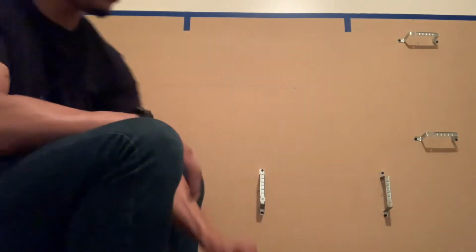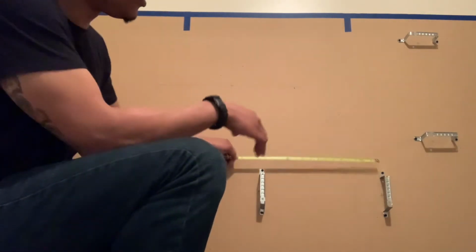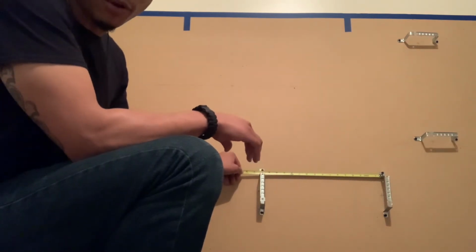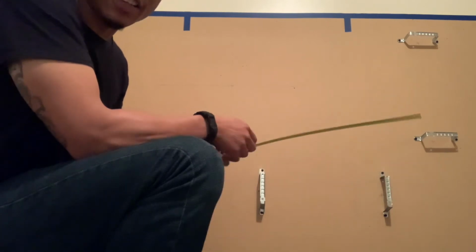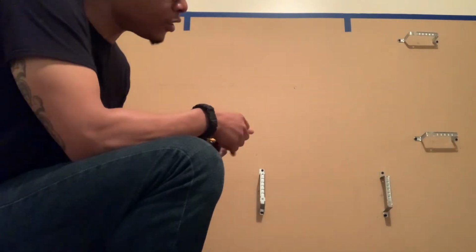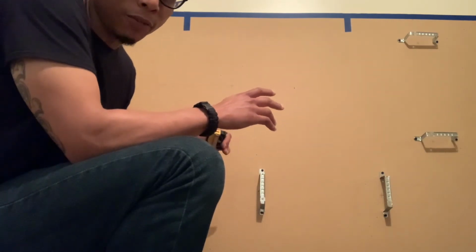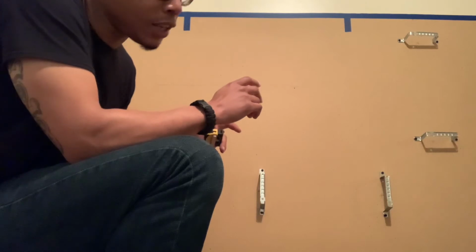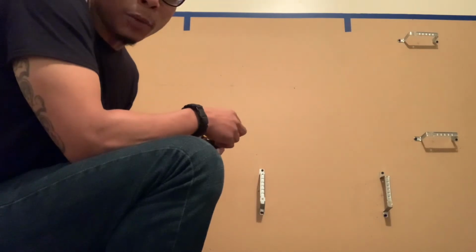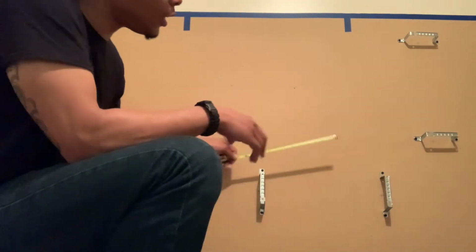But like I said, I added these cable supports, which are like mini wireway hangers. And it's good to have at least 16 inches between each cable support. Some places for horizontal, you can go up to 18 inches and 16 inches on the vertical, but most places I worked at, it's usually just 16 inches as the standard. Now for the main wireways, according to IEEE standard 45, you can go up to 24 inches. They don't want you to go any more than 24 inches. Now I've seen some situations where they went up to 32 inches. But you can't go wrong if you just stick with 16.